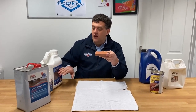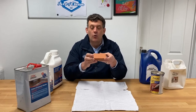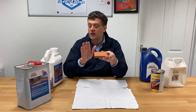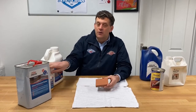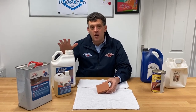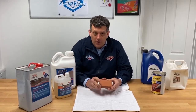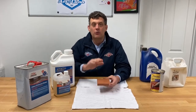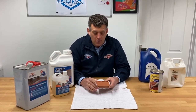What also dictates which method we use is whether somebody would like a sheen to the surface or, like in the example here, a matte dressing. So what we'll do, if the option is not to just have it impregnate-sealed but rather a dressing applied, we'll apply a sealer like Avia and then apply a wax dressing over the top. The beauty is this product is very easy to apply with a flat microfiber mop.